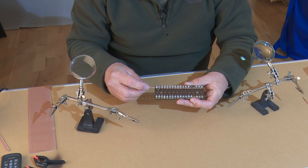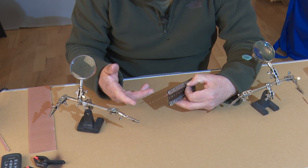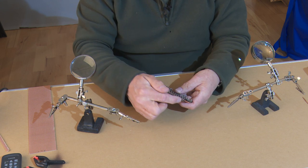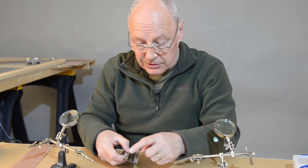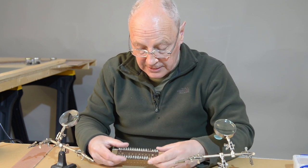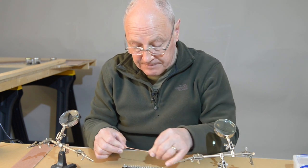And what I intend to do is to solder this onto one of these strips. So therefore, when you connect up your bus wire, or your positive feed for your lights or whatever, you can then use the tags on the other side to take off the power. And then you can use one side for your negative and one for your positive, or if you're AC, DC, that kind of thing, all kind of straightforward. So that's how we'll proceed with it.